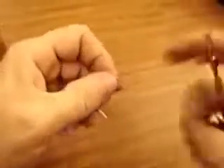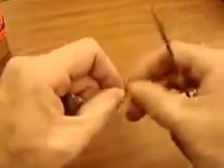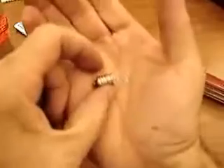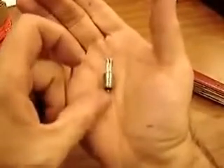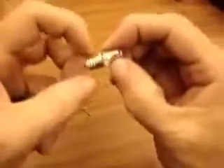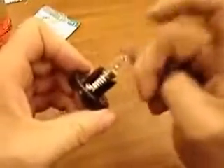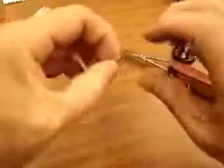You need a tiny light bulb — Radio Shack 272-1139. You can't use normal light bulbs on this; it's a 1.5 volt 25 milliamp bulb. You can also use a number 48 or 49 bulb from mail order — they're the same bulb, just different bases. The 48 has a screw base, but you'll have to crank your generator much harder to get it to light. The Radio Shack bulb is better and more sensitive.